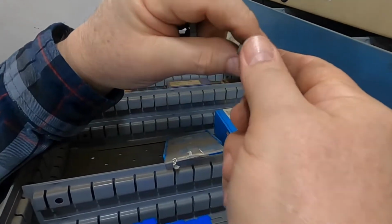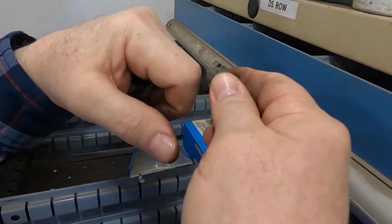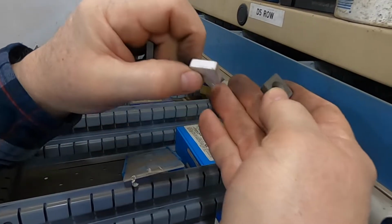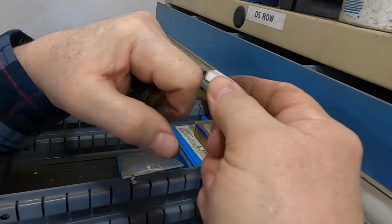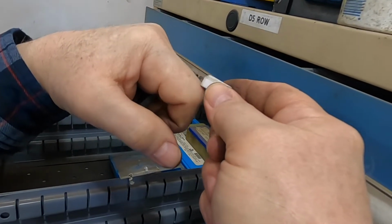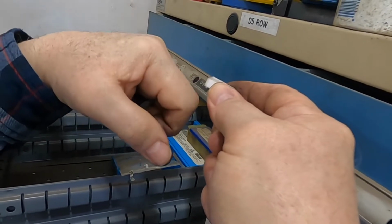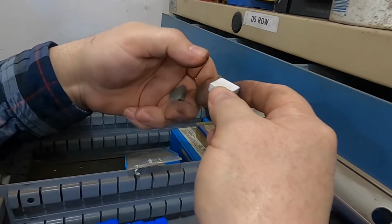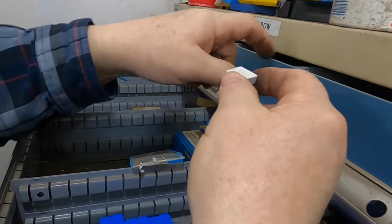On the other hand, this holder for this one is going to be slightly tipped up. So with a slight tip up, if we come in and replace that one with the positive, it's not going to work. It's going to just rub in the middle of the insert instead of cutting. So you can swap them one way, but not the other way.